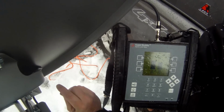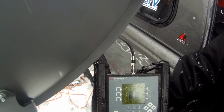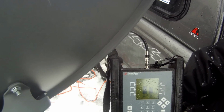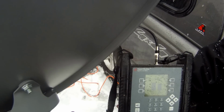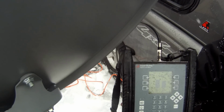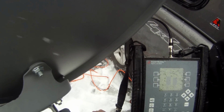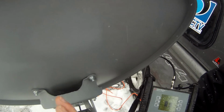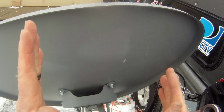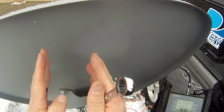So I'm going to count here until I make sure that there's 96. 96 right there. So we got 1, 2, 3, 4, 5, 6, 7. So 7. So I need to go back 3.5 quarter turns. 1, 2, 3.5. And what that is, that found the middle. So I went through 96. So 96 was here and here, and it took me 7 quarter turns. And so divide that by 2, I brought it back to the middle. I hope you understand that.